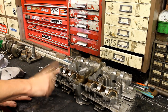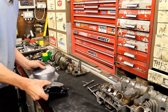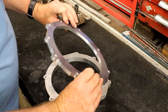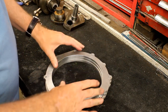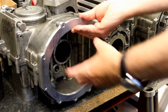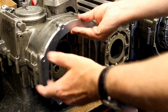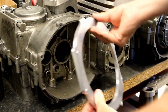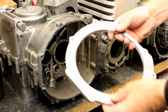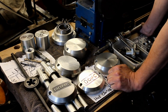I'm here today not to film Kawasaki stuff - I've got a little job for you. Let's put these back over there. Here are those three split plates all finished - just doing a bit of cleaning up, a bit of deburring, but pretty much that's it. Let's quickly go and see where they're going to go on the engine. This is how it will fit on the engine - the clutch fits in there, and that gives us now more than enough clearance for the pressure plate. We should have really started with three-quarter plate - live and learn. The clutch cover is on the lathe.